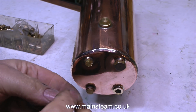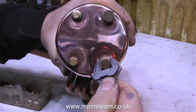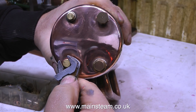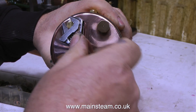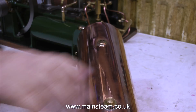The bush on the top right of the boiler back head is for the pressure gauge. I found all these blanking plugs in my box of assorted blanking plugs — I made this one quite a while back, and the piece of hexagon bar it was made from is a bit bigger, but it is still a quarter by 32 threads per inch blanking plug, just like the other two. The bottom boiler bush for the clack valve is slightly different — this one has been threaded 5/16ths by 26 threads per inch. With the four boiler blanking plugs fitted, it's time to give them a slight nip up to make sure they're very tight, in conjunction with the copper washers and the Loctite 542, to seal the boiler bushes perfectly.